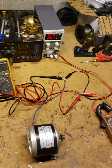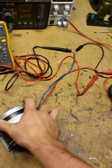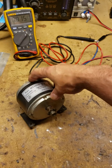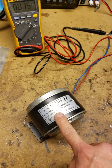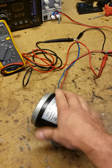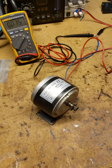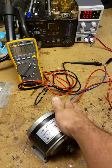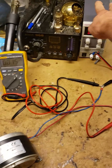Here I have a simple brushed DC motor, very similar to a trolling motor - this comes out of a little electric scooter. It's just two wires, negative and positive. The maximum rated current is 14 amps and the voltage is rated at 24V DC, so this motor is going to function exactly like a trolling motor main motor. The RPMs of a DC motor are directly related to the amount of voltage going in - increase the voltage and the RPMs go up.